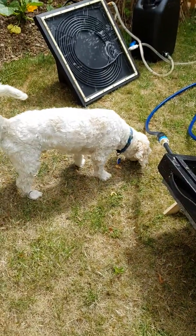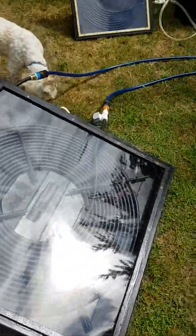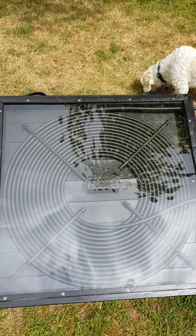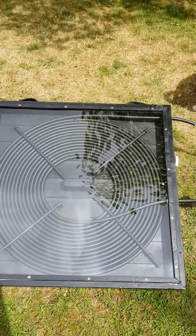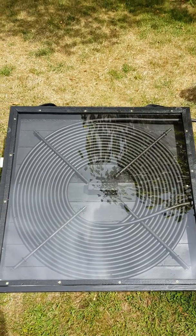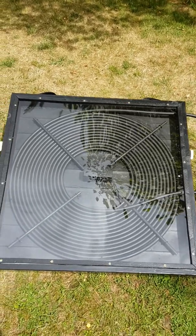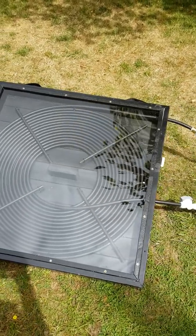Here's a little dog — one of these is the culprit of all the noise. The actual tubing itself is what they call PEX tubing. It was white in colour so I had to paint that black, and I had about 26 metres in there. I bought it on a roll of 50, but I was only able to use initially 28. Having tested it using my mains pressure, it tended to bulge the tubing inside, which meant I had to reduce it down by one ring in order to get it to fit again.